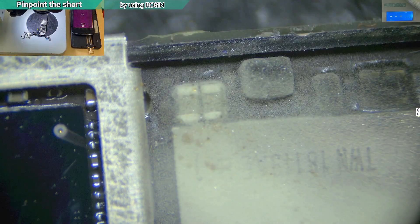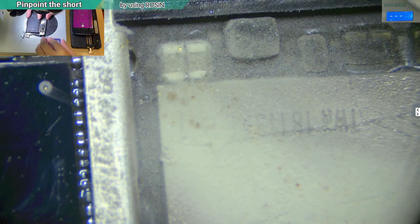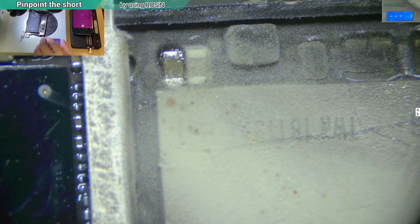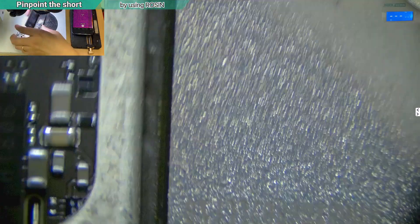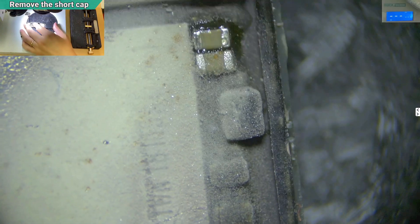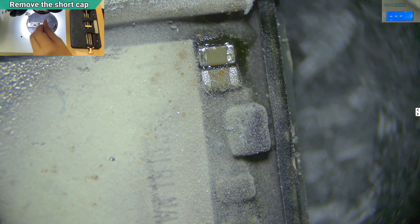This amount of rosin will be enough. Then we watch - after pressing the power button, we see which cap melts first. The left one melted immediately - unplug! So just remove this cap and the problem will be gone.